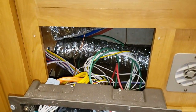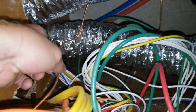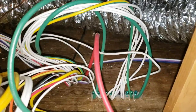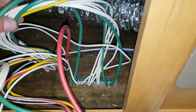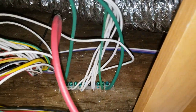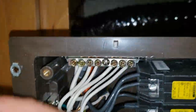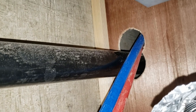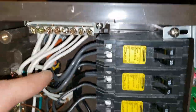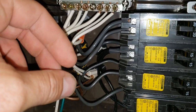The electrical panel is unscrewed from the wood frame of the trailer. There's a main ground going to the trailer frame, and all the other grounds are here. The DC low-voltage side is separate — that's how they get away with mounting it to wood. Here are the mains — that's what I'm tapping into. I can get wire through that hole easily. I'm going to marrette the main wires and then solder it — actually I'll solder first and marrette over the solder.